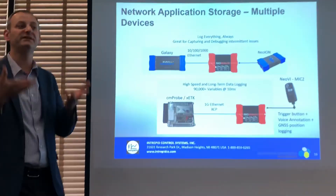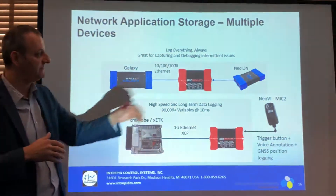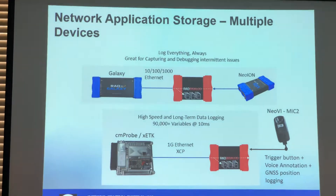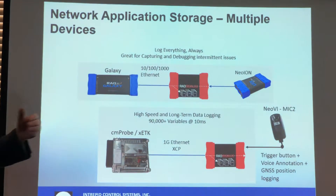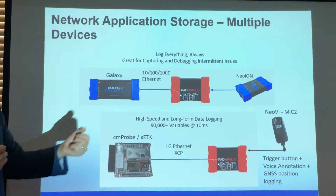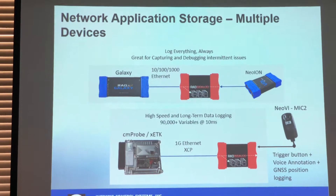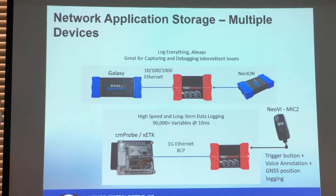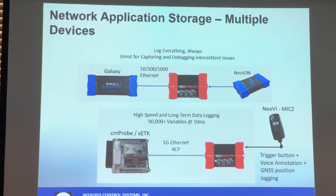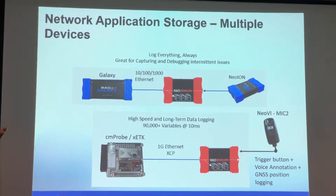This increases your read and write speeds and your capacity to store data. With these other devices, the single card solutions only have so much capacity. When we start talking about higher bandwidth sensing elements like cameras or Ethernet, you need to put these cards in a parallel fashion to increase the ability to write. If you've got a card that only records at 10 megabits per second and you're trying to record 100 megabits, you're going to miss 90% of the data.